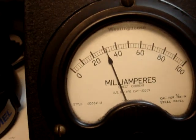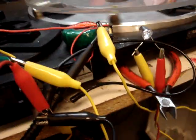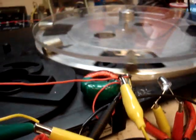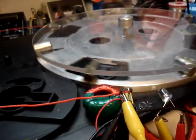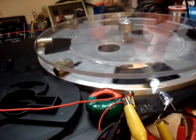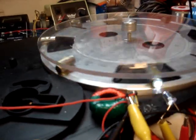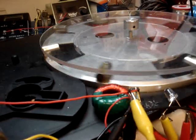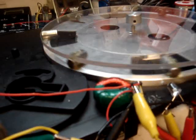Just wanted to show you those two things. This motor is running at right at 31 milliamps at 0.676 volts. And I've got 20 or 30 hours of run time on this turntable now. It will run down to approximately 0.59 volts at about 22 milliamps, and then it will simply freeze up because it can't overcome the pull-in on the core there.